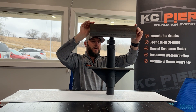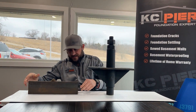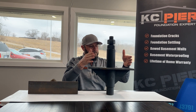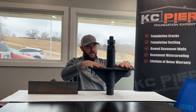The recovery process does not work if the pier is not driven straight. One of our guarantees with the recovery is that this is straight up and down at a 90-degree angle. That way we can put the lifetime warranty on the pier itself.